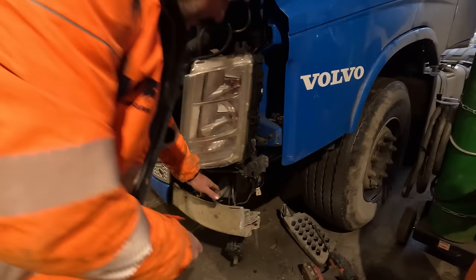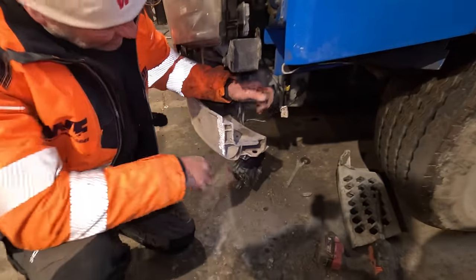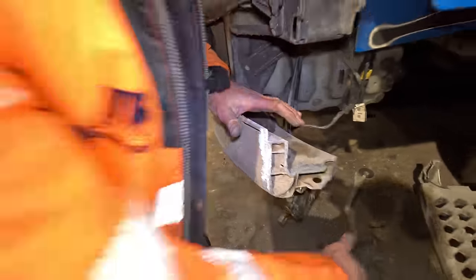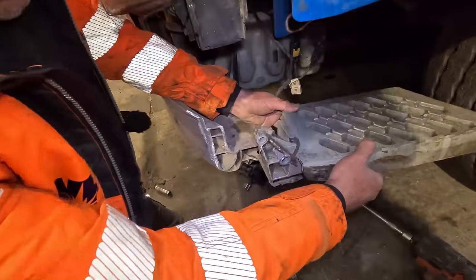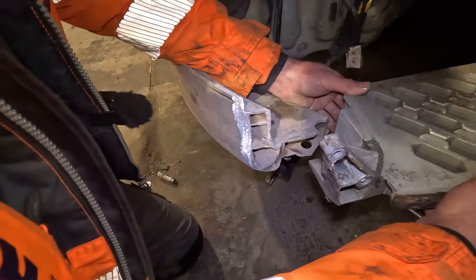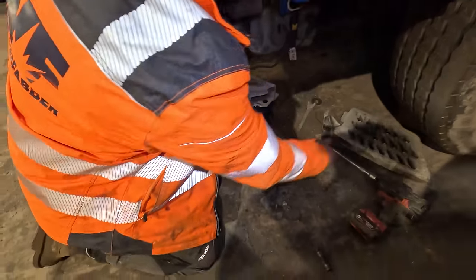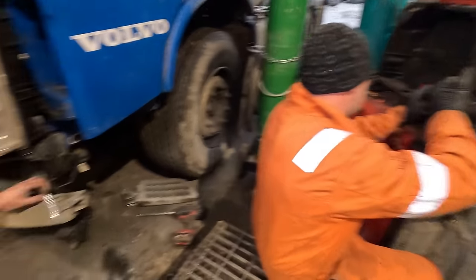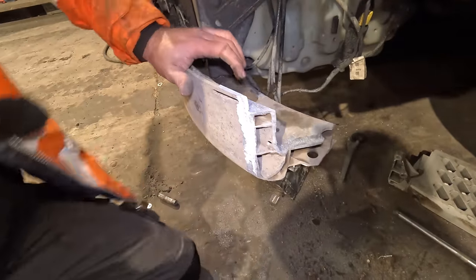Right, so it looks like this near side front corner's had a bit of a bang. Did it break off, Paul? Yeah, it snapped off in about 3 or 4 places. Right. So the aluminium stepper bolts to a bracket that goes there, can you see that's been snapped off? So Paul's just rebuilding that at the moment, putting aluminium wire into the MIG. Callum's off on holiday this week, he usually does all the alloy welding, so we'll jump over to the MIG on that one.